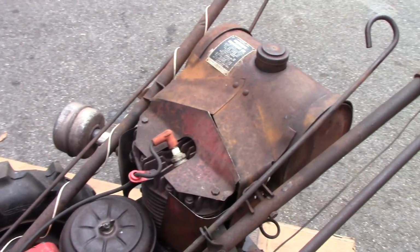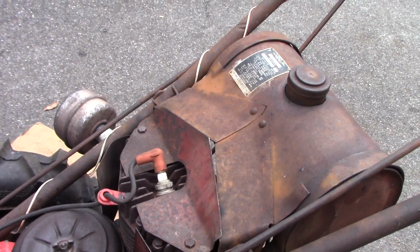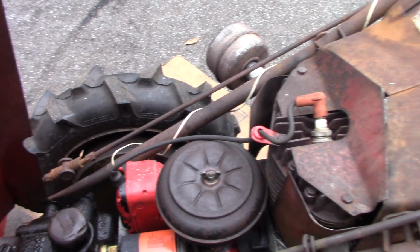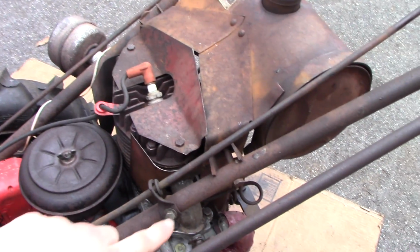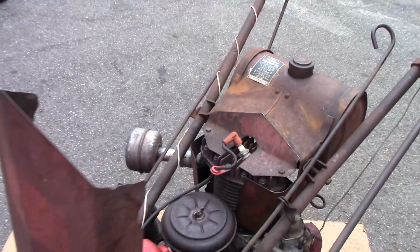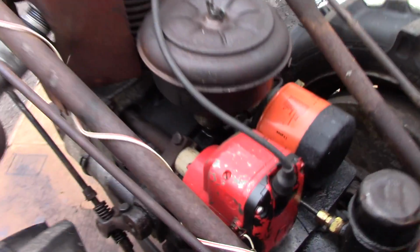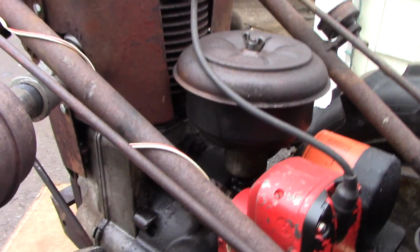It's a super torquey engine. It's a bit of a torque monster. Oil bath air cleaner, which is in the center here, and it's got like a tube that goes around to the carburetor. It's magneto fired. So if you look over here, T-heads are also twin cam engines. So there's one cam on each side, each with one lobe.